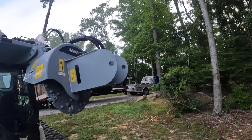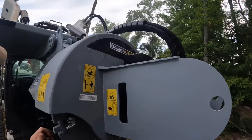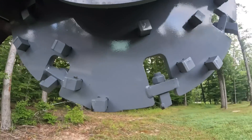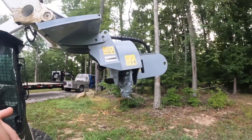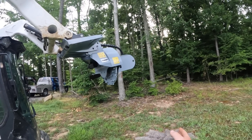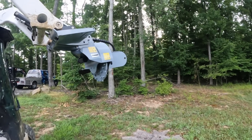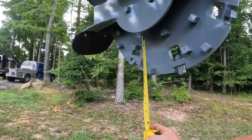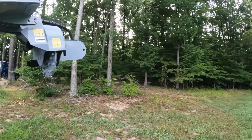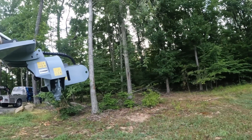Keeping it simple, they come with some replaceable teeth from the factory — carbide-tipped cutters. We can get teeth for you, whatever you need. This is the first time I've used this type of stump grinder. I've used the swing grinders before where you pull up and park, swing back and forth — they work really well too. This one has a 24-inch wheel. Looks like about a six-inch depth of cut, which you can cut with the teeth. Basically start at the front of the stump and walk your way back as that pivot cuts.